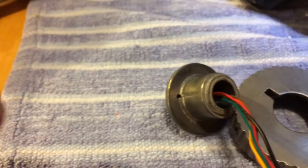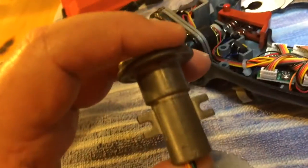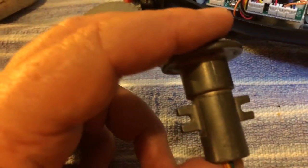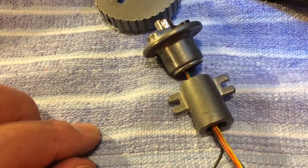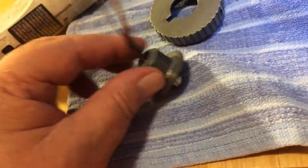This piece should look like — how can I do this? — this. This is the assembly that takes all the strain on these two nuts here. And snap. With this side not even being connected — there was no screw — and on this side there was a screw as you saw. So we are going to replace this. All that comes through broken — broken piece one. I think we can now push this through.